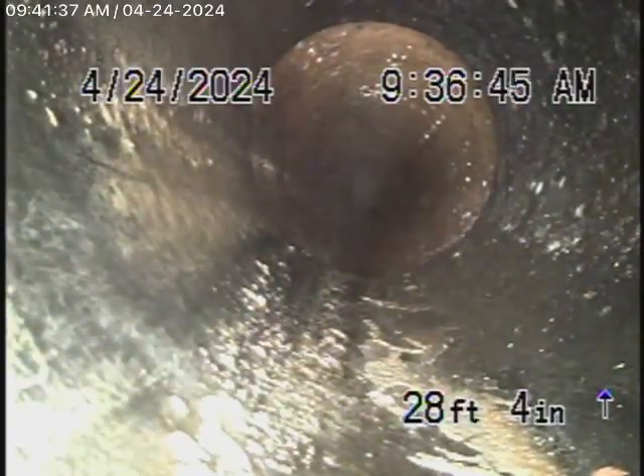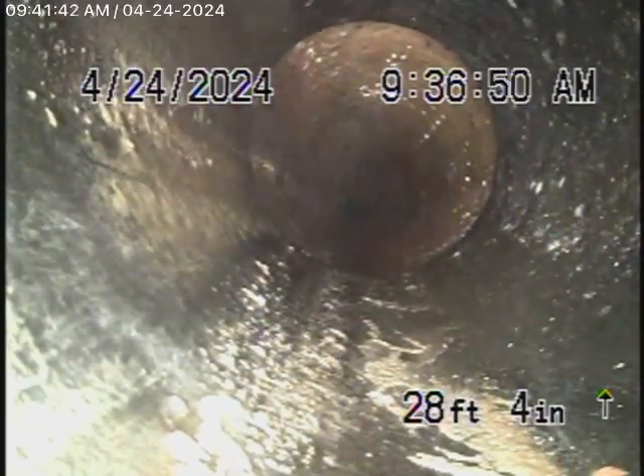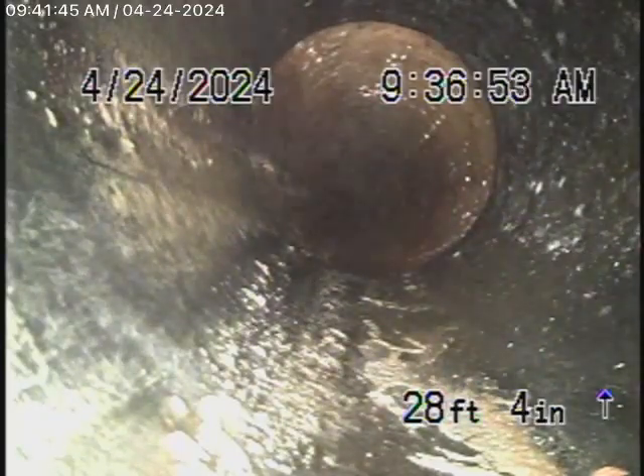I've located that just about a foot underneath the sidewalk over here. Obviously, they extended the 4-inch pipe a little bit into the public right-of-way. Coming back from here, it's all ABS plastic and all in good condition. So everything looks pretty good here except the city connection over there and the lining — that can be a problem. It's also very deep in the street. As it comes out of the clean-out underneath the electrical meter over here...